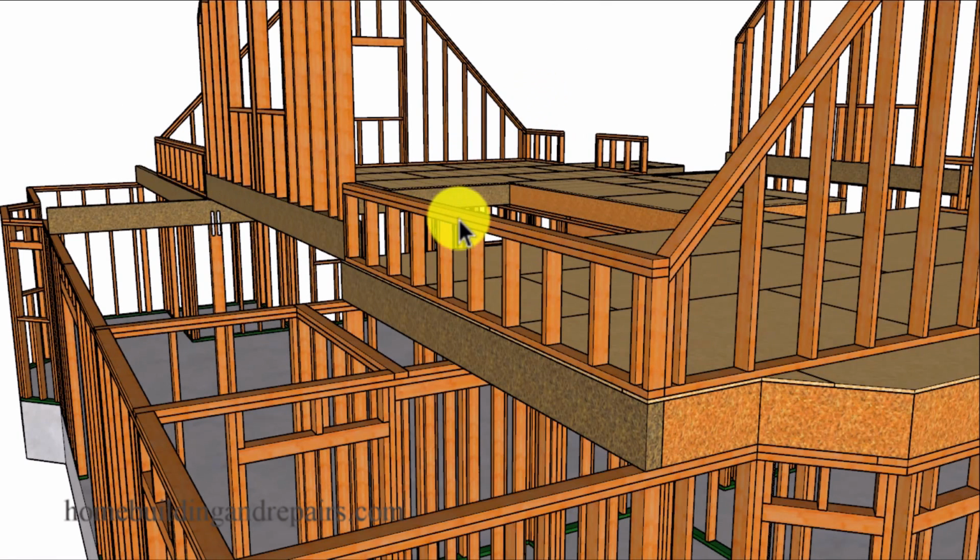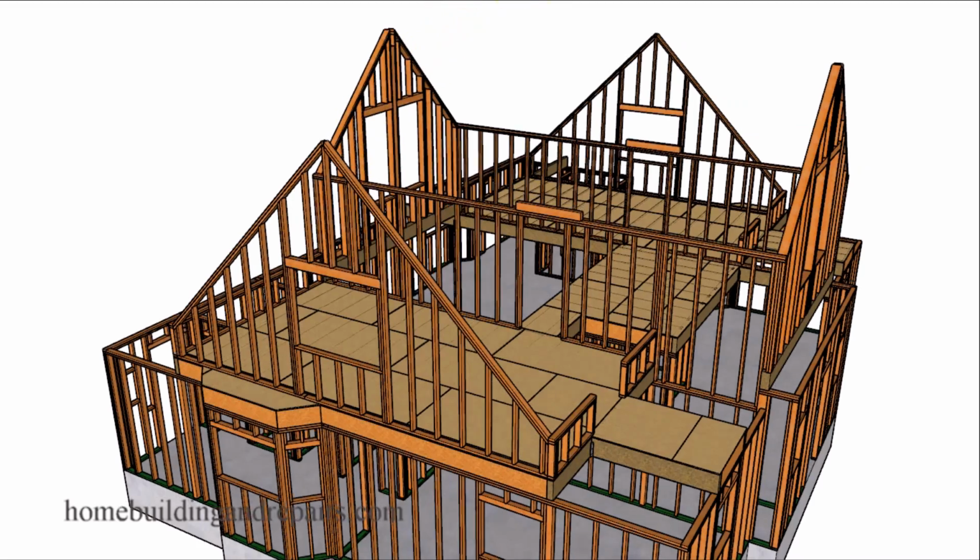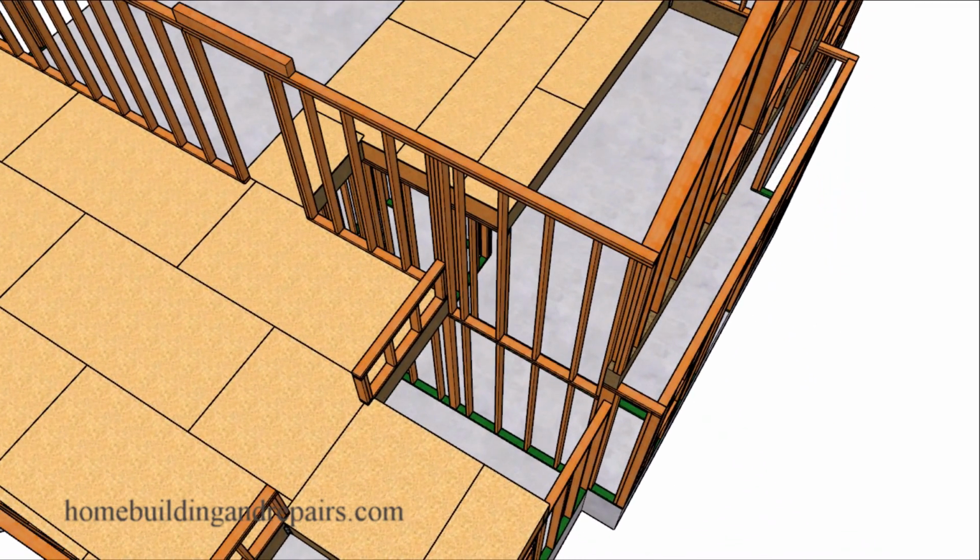And these walls here again will be the same proportion or the same size and will be supporting the bottom of the roof rafters. And that's the reason why this part of the wall continues through to the outside and not butt up against this wall here. However, I'm not about to suggest that you couldn't have that rake wall go all the way down. And the simple fact that this building is built in sections that have the same proportion and similar measurements will allow you to calculate the measurements for some of these walls a little easier than it would if they were different measurements and different sizes.